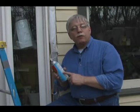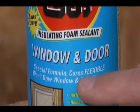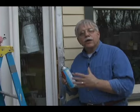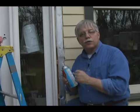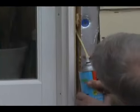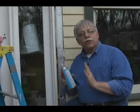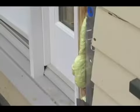The spray foam insulation I'm going to use to insulate and seal this exterior door is very important. Get one that says it's flexible on the label. As the foam expands, you want it to stay flexible so that it doesn't squeeze the door too much and make the door tight and not fit in the jamb. Also, be sure that you only fill the gap about halfway. As the urethane foam cures, it actually expands, and if you put too much in, it'll come oozing out of the crack.